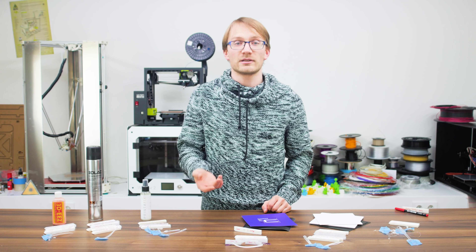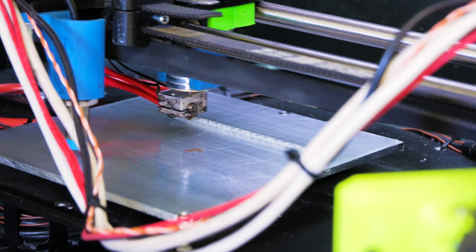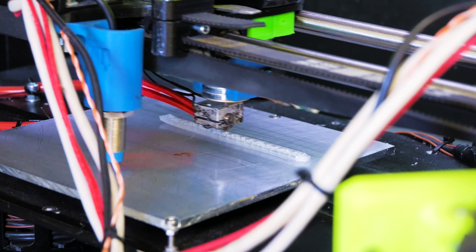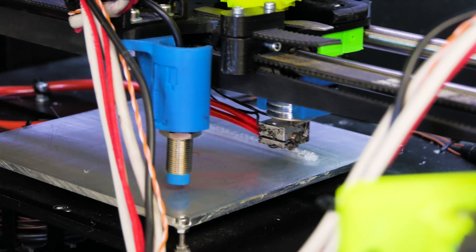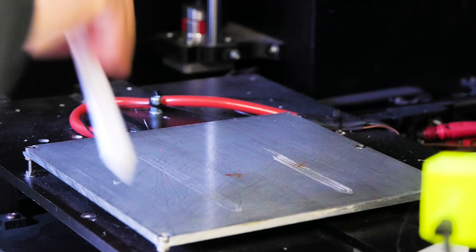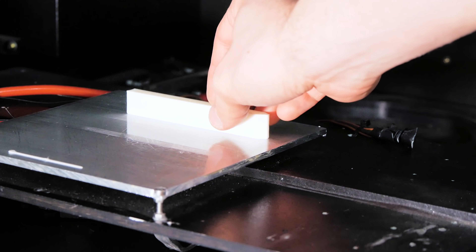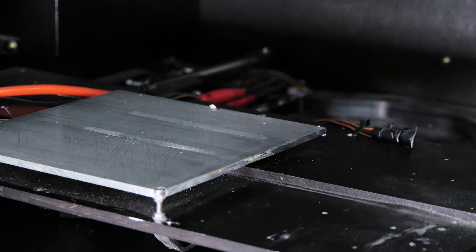To completely remove it and start over, you can easily remove it with acetone. But for printing, it works amazingly well, especially for cold prints. The heated prints obviously all worked, but even the cold prints with PLA and PET were surprisingly good. Cold ABS still failed. And as a bonus, since the 3DLac actually comes off the bed with the print, large prints will often just pop off when they cool down after you give them a slight tap.